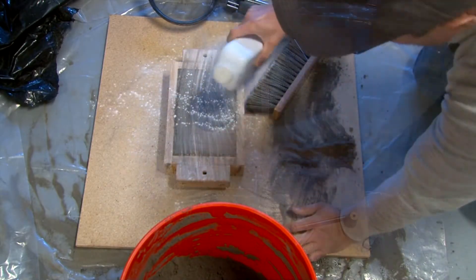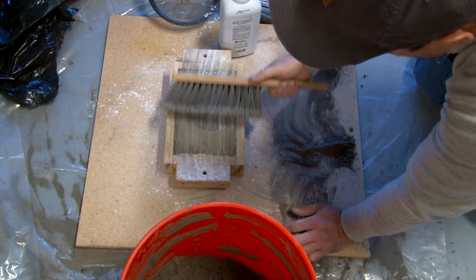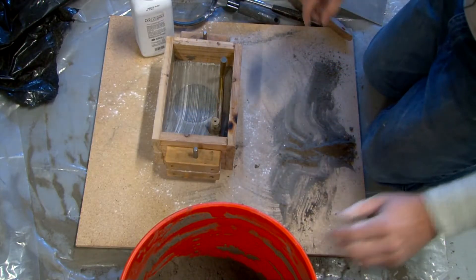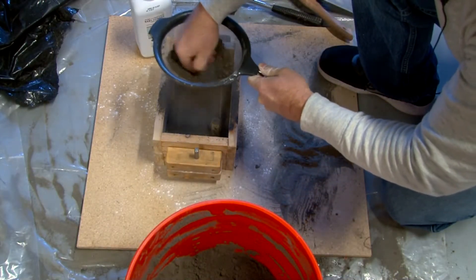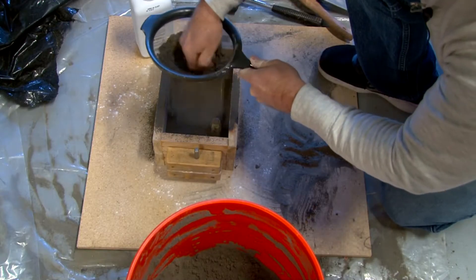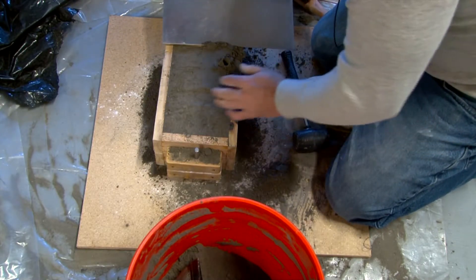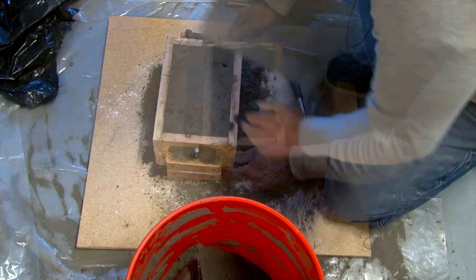Now I'm just scraping it off — I use a sawing action. Here's the part I just packed with sand upside down, flipping it over. You can see the pattern in there, and I'm putting the parting powder in there. Now I'm putting the sprue in right there, locking it into the 3D printed part, and there's the spin trap. So when the aluminum's poured in, it'll go past the pattern and into the spin trap to collect the first bit of contaminants and sand that may have fallen in. I'm screening it again so I have a good finish on my parts — probably not necessary on the back side, but it still comes out looking nice. I'm sawing it off and flattening the back out with the sand.